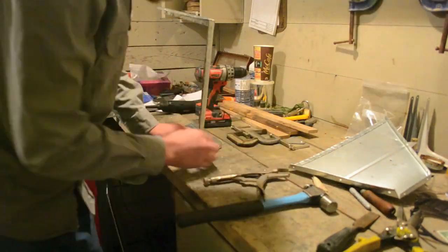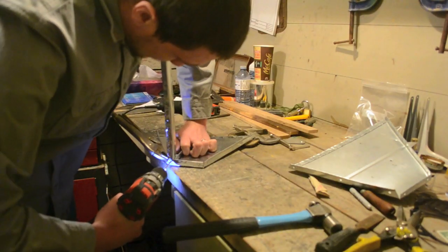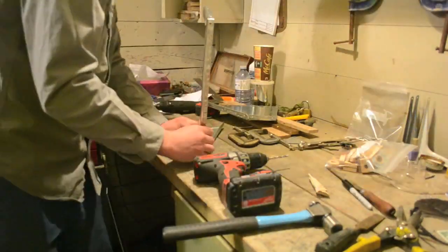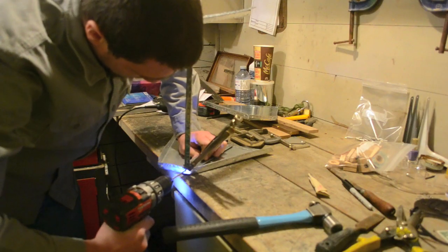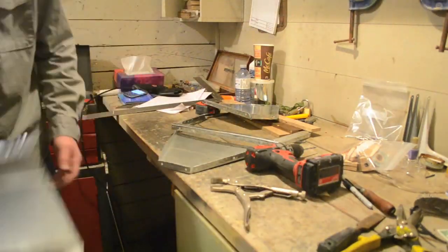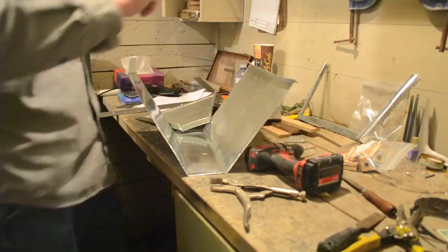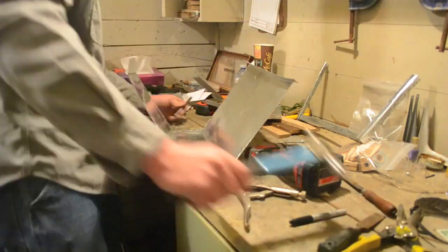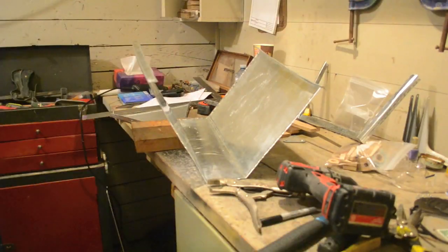Line up the shelf support with one of the back holes, clamp in place with a set of vice grips, and pre-drill a hole through the shelf support. Do the same with the other side. Then take your back panel, line up the side flush with the outside edge, and mark where the 2 back holes need to go. Mark with your center punch and drill these holes.